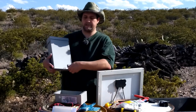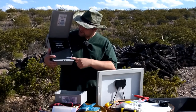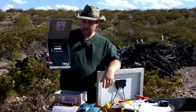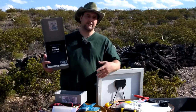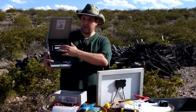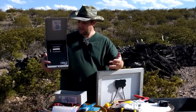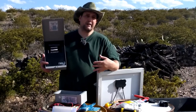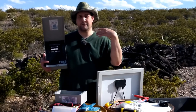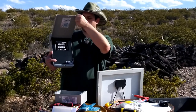These do come in different sizes — here's one that holds up to six and is wired for five. Why would you need three versus five versus twelve? These are strings of panels. This is where you combine them in parallel, while strings are the series combination. Just know there are different sizes.